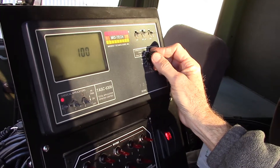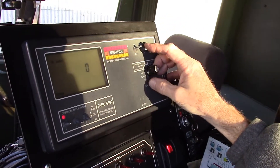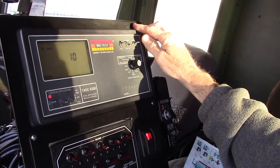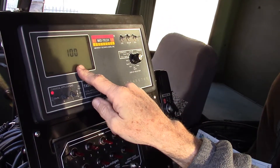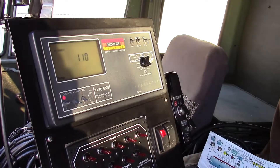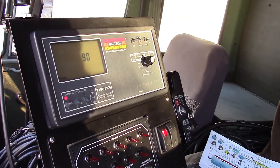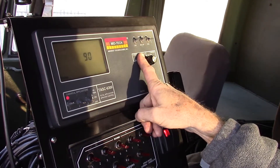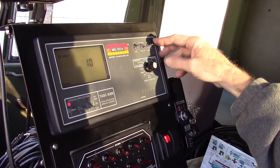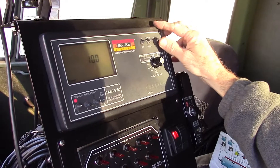'Percent rate' is a boost rate — at 100 percent you're putting out the full volume. In setup mode you can increase or decrease it. For example, a boost rate of 10 percent would allow you while spraying at 64 ounces to the acre to boost output by 10 percent on the go, or cut back to 90 percent of 64. It's an advanced feature — often we'll zero it out. In operate mode you'd want it at 100 percent, but to disarm it you can go to setup and change that increment to zero so an operator can't accidentally change the operate value.